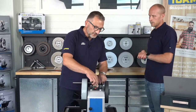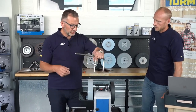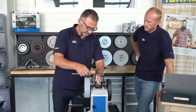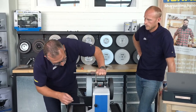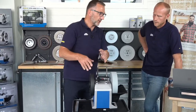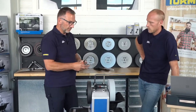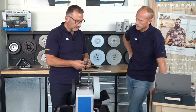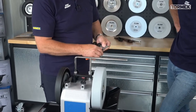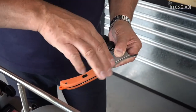The freehand style is done - now I want to show you how you can do it with the jig as well. I'll show how it works going against it because then you have a little bit of guiding. But I prefer freehand - it's much easier and faster because you can see the bevel clearly. Clamping this one is a little bit like that - more or less the same shape in the middle.